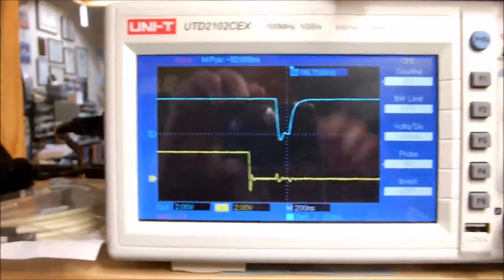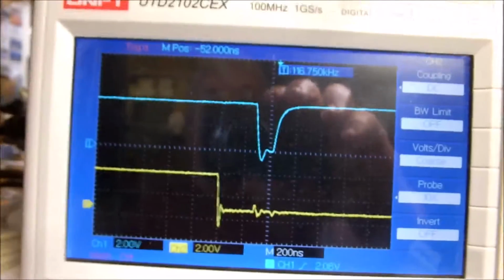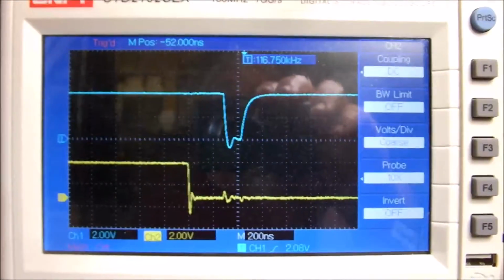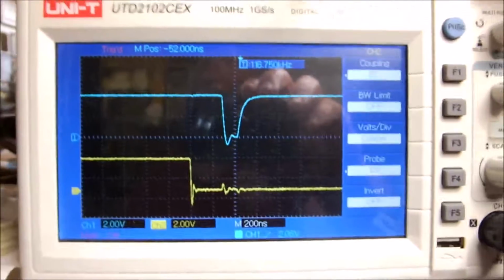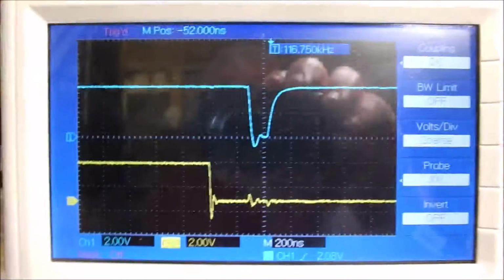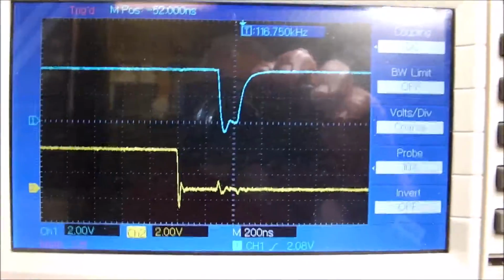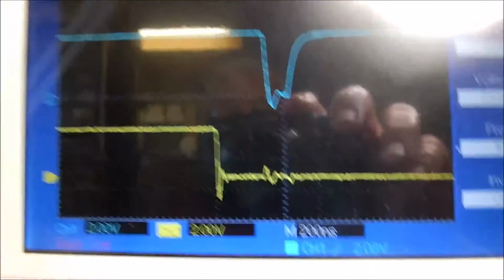Now, the way to find out, I'm going to jury-rig the board to keep that line active like it was before, all the time, and we'll see what happens. I kind of suspect then it's going to work, but I think that the line driver chip is going inactive before the memory chip gets that write signal. But the delay circuit's working fine.